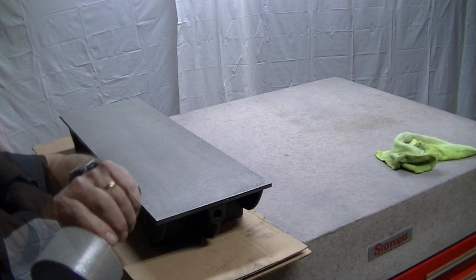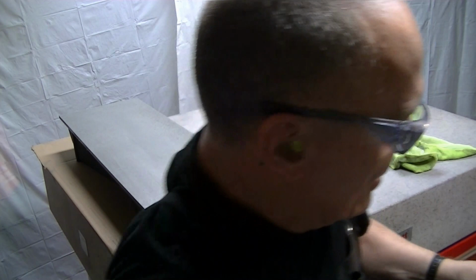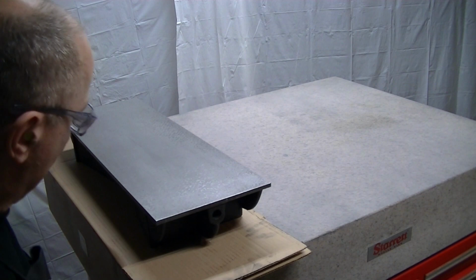So the outside of this roller is all coated in diamond. And I'm not disturbing that, not wiping it off, just letting it sit on there. I'm going to try leaving that on and just see how that behaves with just a trifle of free abrasives in there.